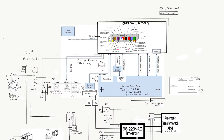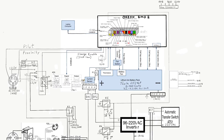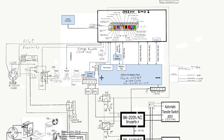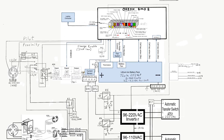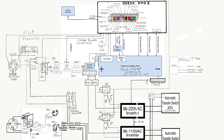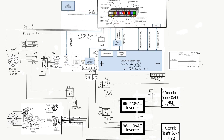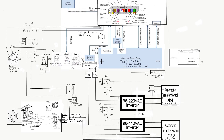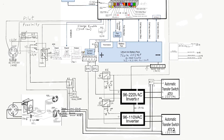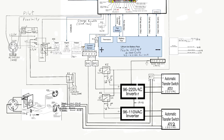This is the schematic of the system — minus the solar and a couple other things — but I have the EV charge system on the upper left, where I can identify an EV charge station and charge at up to 6.6 kilowatts. The lower part is the RV power — shore power or granny power — 120 volts through 220, with logic and relays that detect 220 volts and will enable full charging at that rate. There are many hours I could spend talking about this, but I'll get into it in further videos. Thank you for watching as I progress here through the spring of 2020 — thanks for listening and subscribe.